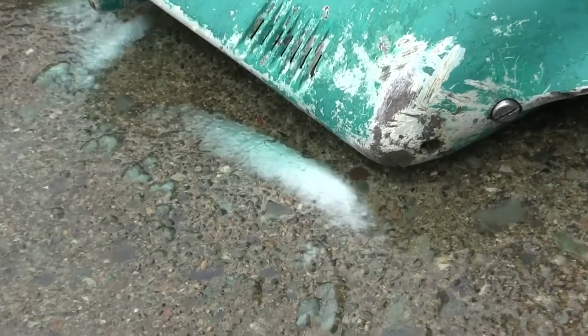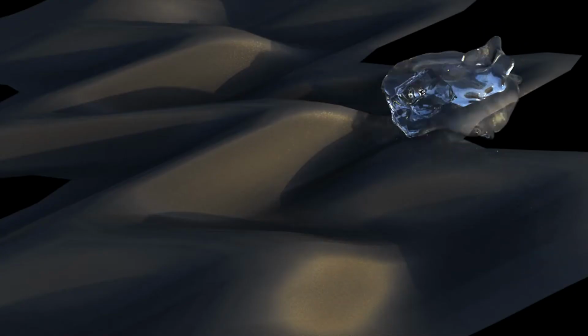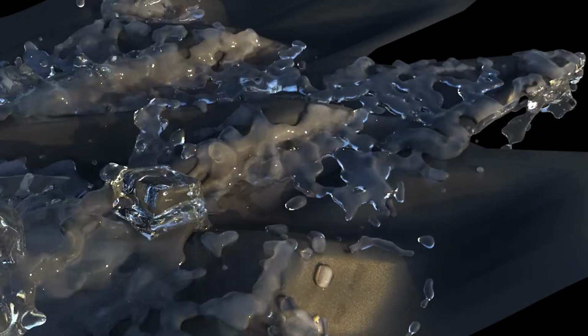The liquid phase helps to suppress dust by entrapping it within a mist of water, but it also gives the parts a wash. The vapor phase acts to reduce leftover moisture. The energy of impact vaporizes much of the ice, leaving behind much lower amounts of water.